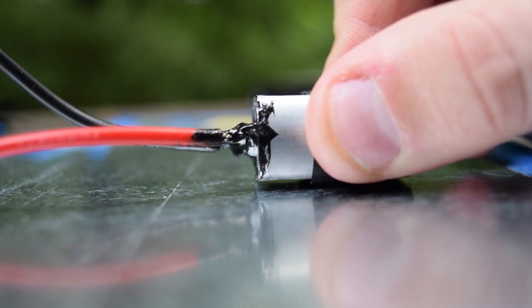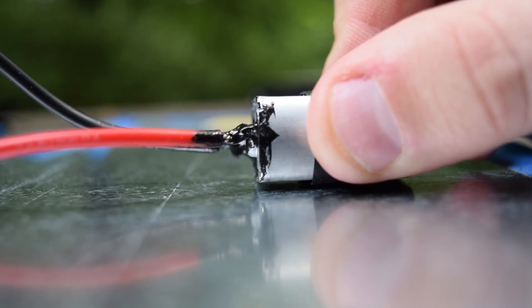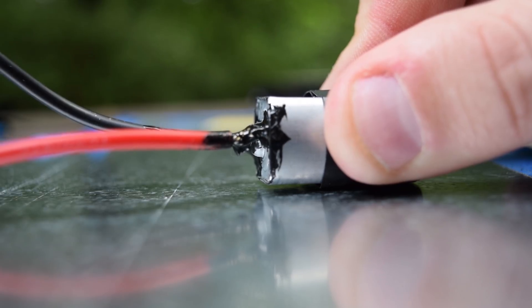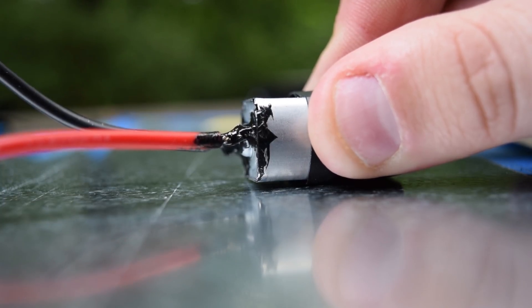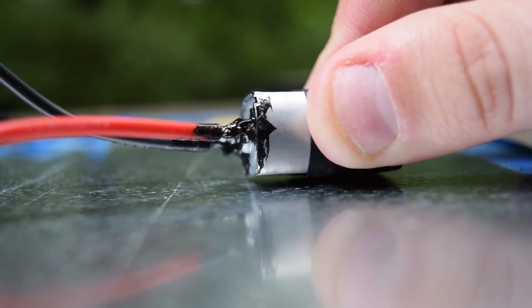Before the conclusion, there was a complaint circulating on Facebook that the Fang could arc out of the motor onto metal cages, which is both dangerous and really odd-sounding. So I decided to use my own science-y methods and put it to the test. I made a simple circuit connecting my LiPo to a single Fang with a switch in between them, put E-tape around the motor, and placed it above some aluminum. Nothing from the motor was touching the aluminum and the wires were covered with liquid E-tape to make sure they weren't shorting to the cage.